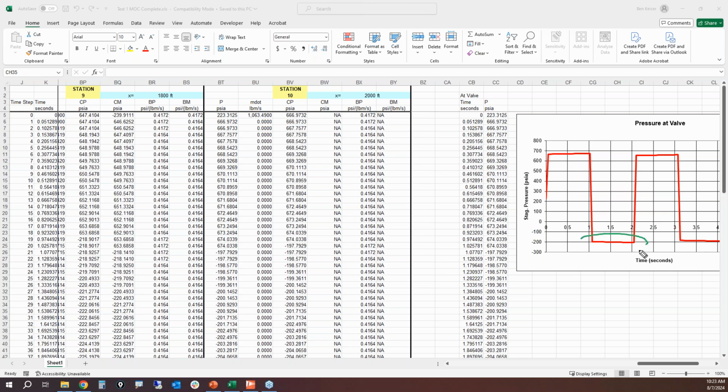Now, we do actually see negative absolute pressures. What in the world is going on that we see negative absolute pressures? Well, this is something that will happen mathematically. What this indicates is that there is cavitation going on during that time frame. And so how far negative that pressure goes can give you an idea of about how large that volume is going to get. So this is one of the traditional methods of evaluating cavitation, where if it goes negative 200 psi, then you could expect to see a 200 psi pressure spike when the vapor bubble collapses, and we have the next pressure spike right here.